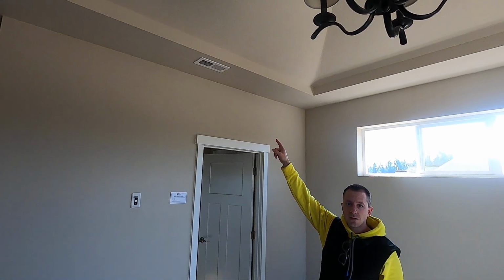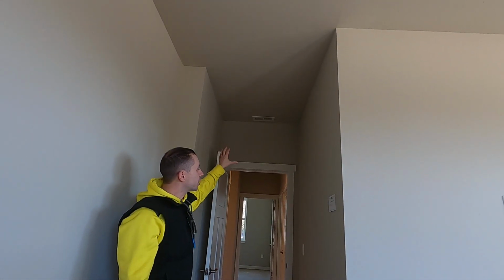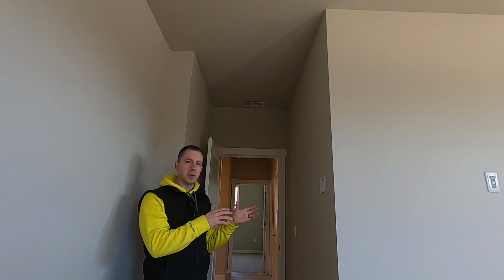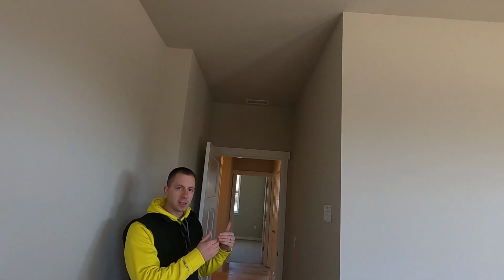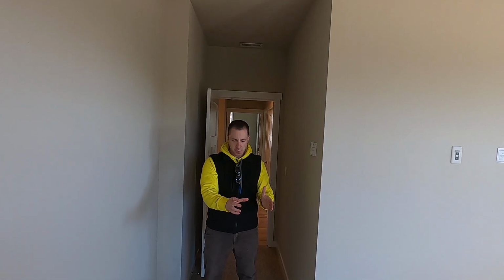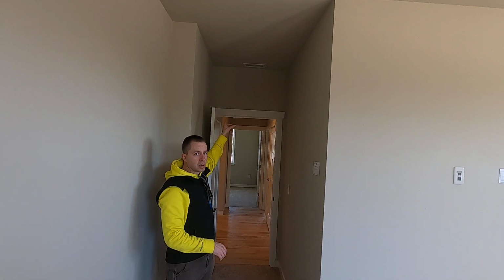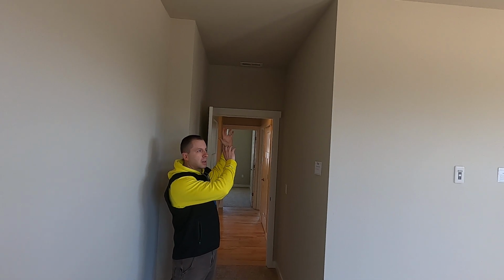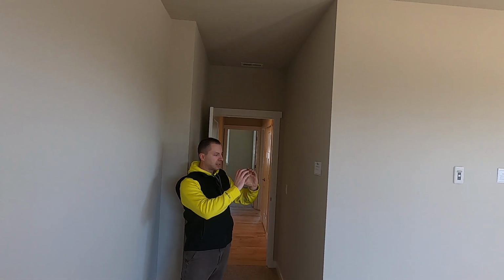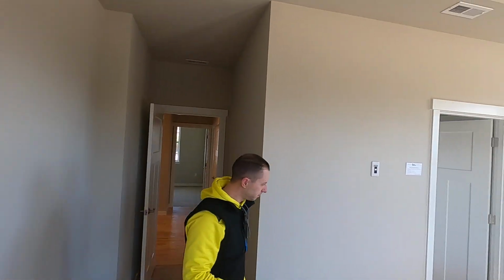This is supplying air to this room, and this is extracting air. So in this particular configuration, what we've done is we've taken the ERV, I'll show you where that is in just a moment. It pulls the fresh air from the outside, and then with the ducted unit up in the attic, right on the front side, is where the supply comes in, and then it distributes out through all of these ducts. The extract air comes from the bedrooms, only the bedrooms in this particular home. And it all combines into the exhaust side, which goes to the ERV and exhaust. So it's a balanced system that's turned on all the time.